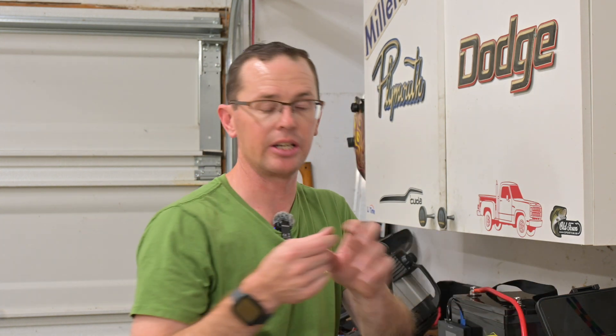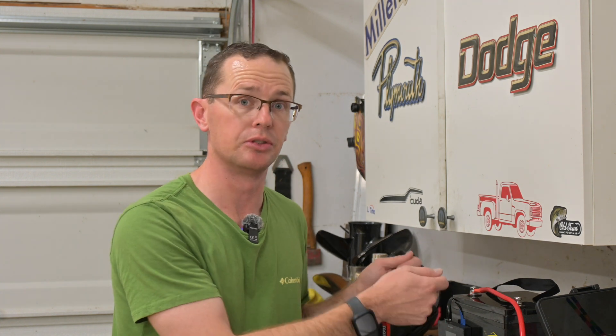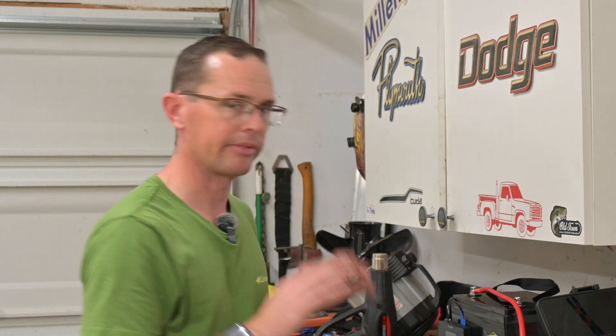Let's go ahead and hook it up. One thing I want to mention: if you're hooking up an inverter for the first time, it's got some big capacitors in it and you'll get a pretty hefty spark. The primary way to mitigate that is to find a resistor or some sort of load that you can put through it to help keep the spark down. Don't be alarmed — you haven't shorted anything out, but it is going to load up those capacitors as soon as you touch it to a battery. That's perfectly normal.